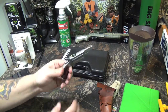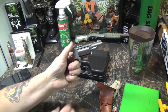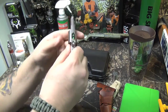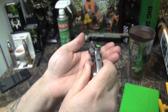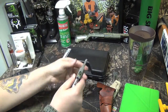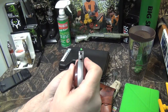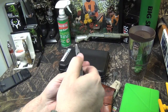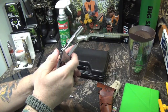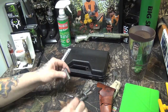Here it is — it's pretty nice. It sits better in the hand than you'd think. I hold it with my middle finger around it and you get a good grip on it. My only gripe was there was no rear sight, so I added this fiber optic sight — I epoxied it on last night, and I think it came out pretty good. To drop the cylinder out you take it to half cock, push the little button in the front, slide the pin out, and drop the cylinder.